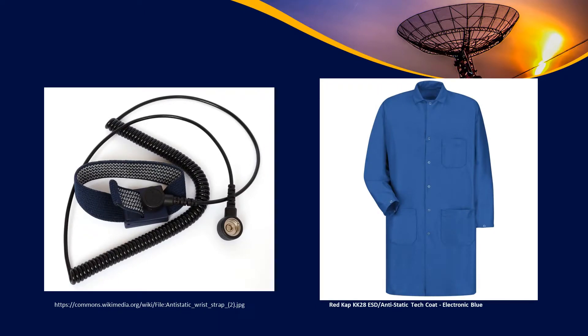The most common type of protection — and this is something I recommend even for the simplest CubeSat — is electrostatic discharge (ESD) protection. At its basic level, you'll have a wrist strap connected to some kind of a bench. If you've ever been shocked by touching some material, or seen your hair stand up from rubbing a balloon against it, you've seen static discharge. Even a small amount you can't feel can be enough to damage a satellite or other sensitive equipment, and sometimes it's not immediately obvious that the equipment has been damaged.